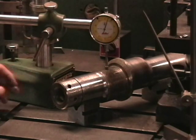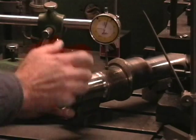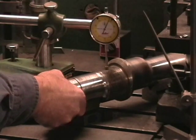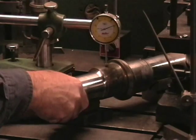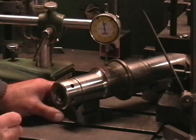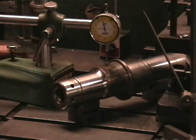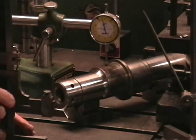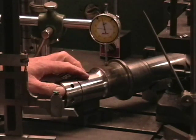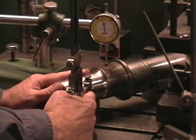I should show about five minus when I bring the lobe back up — about three. So I'll adjust it off by one, about four. That's close enough. The height gauge — I've already taken it from this — this is a bearing diameter: shaker screen, roller bearing. And set it for center.